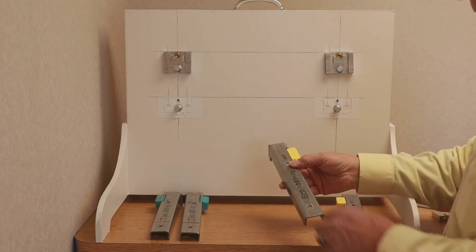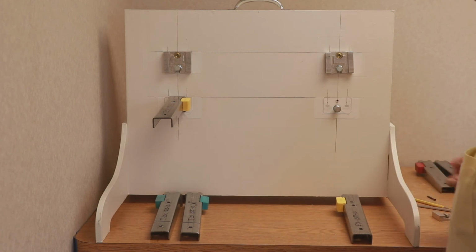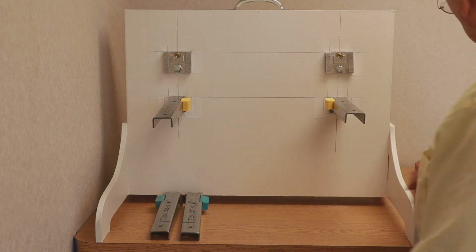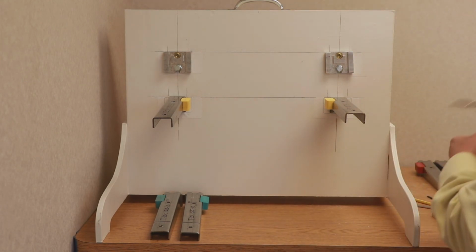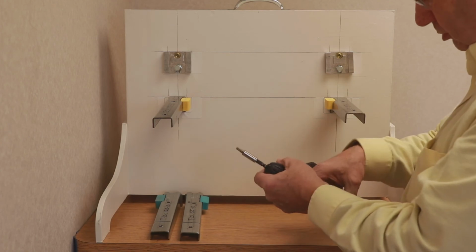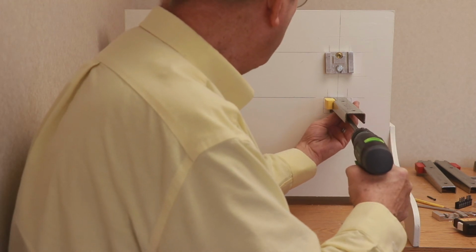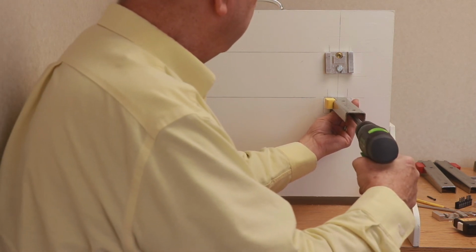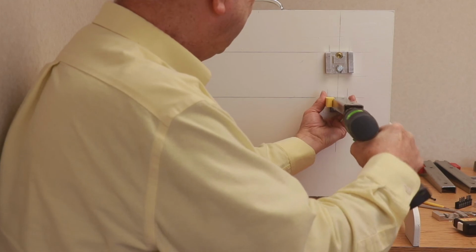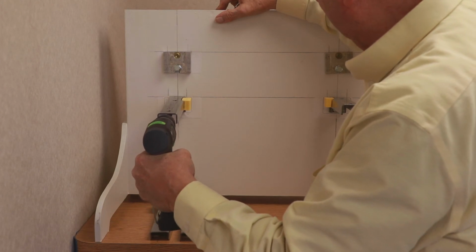So instead of using a mounting plate, you just put the bracket directly onto the lag bolt. Just set it right on there, right into the saddle. The only thing you have to do is put in the structural screw. It's a little tricky. It requires an extension on your drill bit in order to reach that structural screw. We have to find that hole for the structural screw. And now that we got this nice long extension, it's just a simple matter of screwing it in. Done.